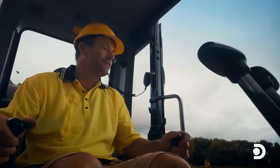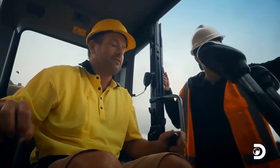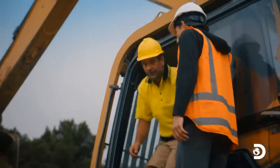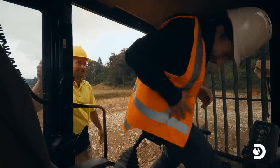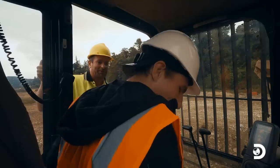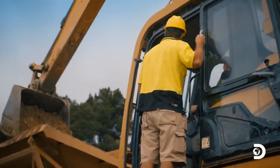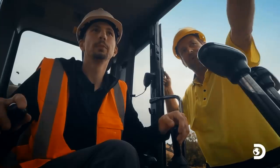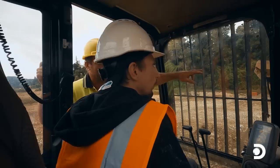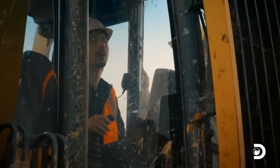So what kind of controls do you guys run on these? Cat. Are they cat controls? You wanna get in there? Yeah. Righto bro, I'll hand her over. Normally with the trommels you can tell if the rings are dirty halfway down — you're feeding it too fast. You only really want that top section running dirty. Gotcha.